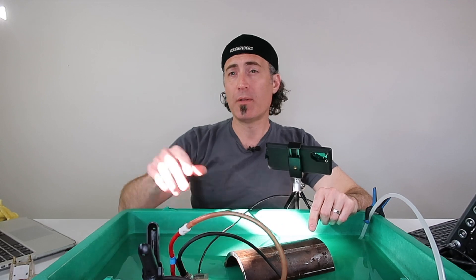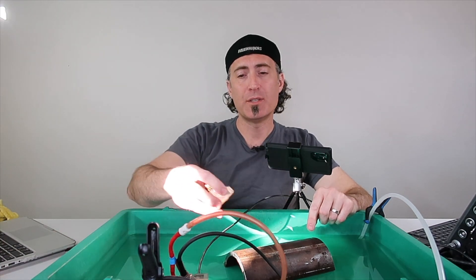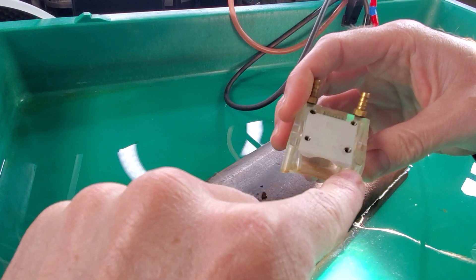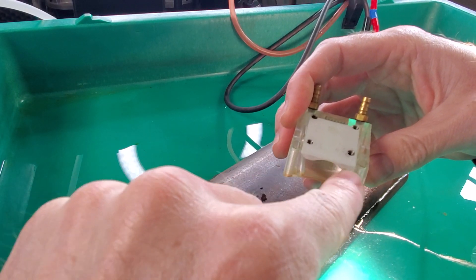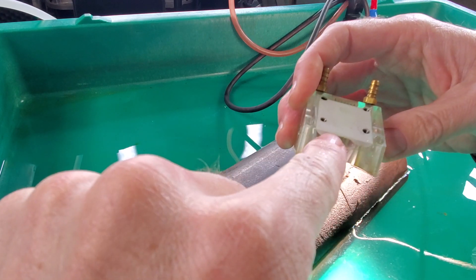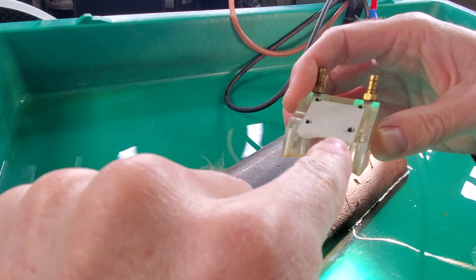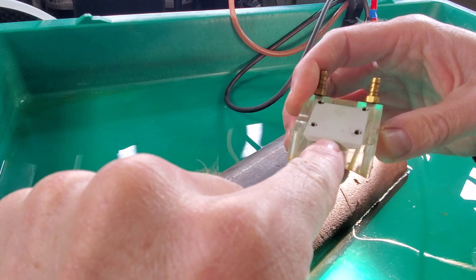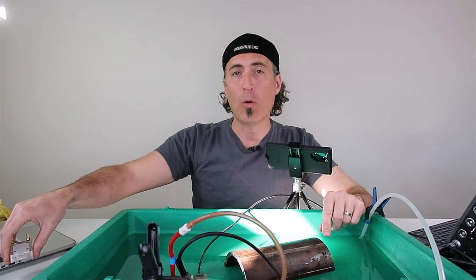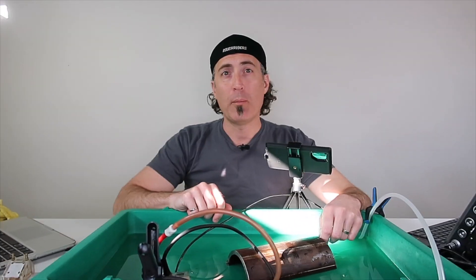What Olympus has come up with to try to counteract the effect of divergence is a passive aperture focus, or PAF wedge. Just like it sounds, it focuses the beam in the lateral direction as the transducer sits on this surface here. You can see the outside of the insert is shaped differently than the inside, and this is going to try to focus the beam in the lateral or passive aperture.